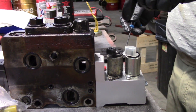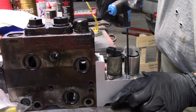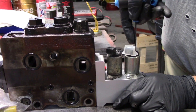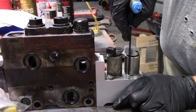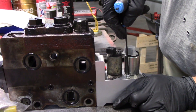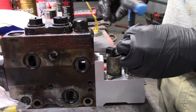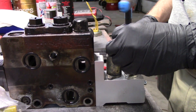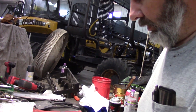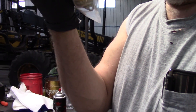That's basically how to change a solenoid on a valve bank slab. When you get a tight one, give it a good twist - you hear that snap. In the brake cleaner, make sure you get into the heads of the screws and pick that crap out. If you don't get your tool in far enough you're going to strip that head out, and then you're going to be screwed - literally. Make sure your tool goes in all the way and give it a little snap.